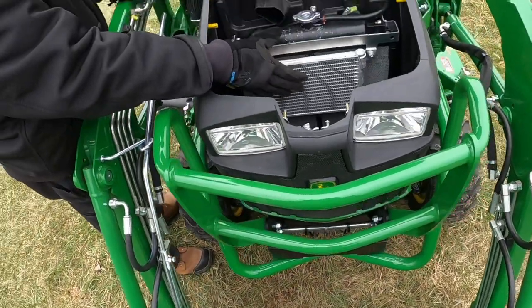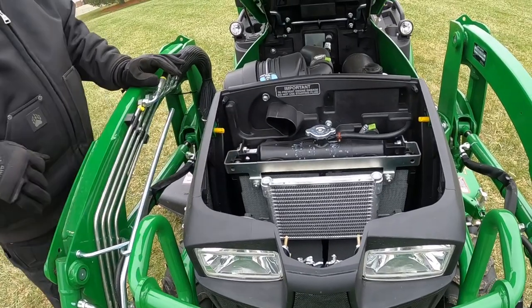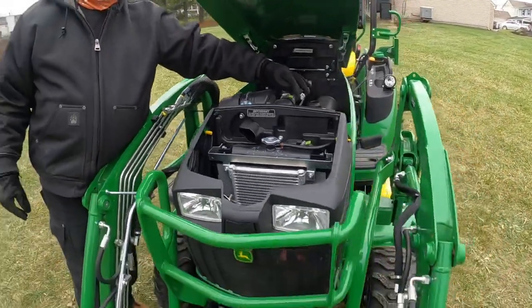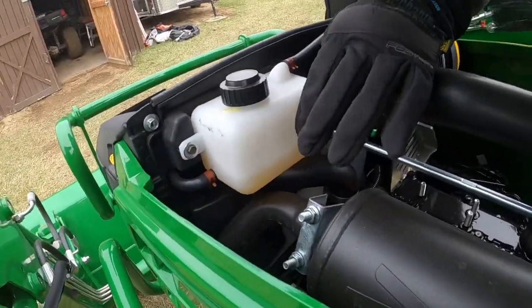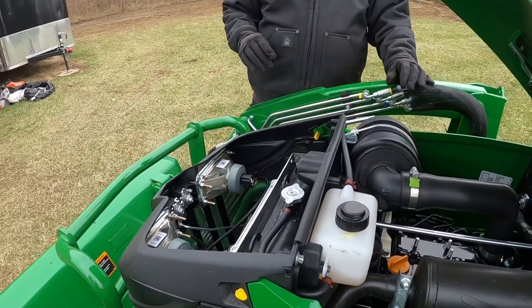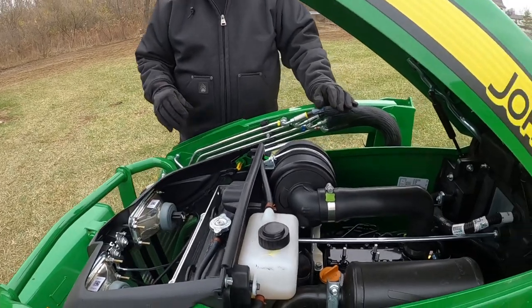That's your hydraulic oil cooler, and then that's your engine antifreeze. Okay. That's your little radiator overflow right there, and that's the cap. Okay. And you can keep an eye on it. If it gets low or something, you keep an eye on it right there. That's where you would fill it, and then whenever it needs, it would draw it into the radiator. Okay. Don't take that off if the engine's been hot. Right, all right. It could blow out in your face. Yep.